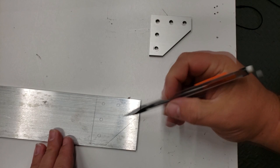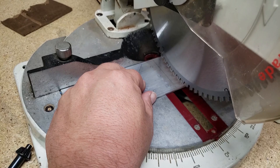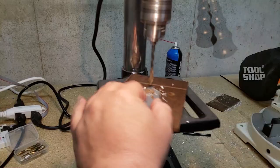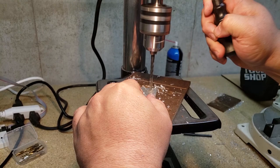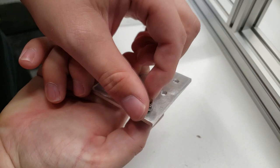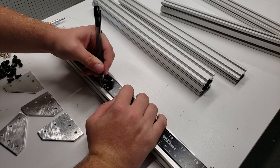Let's start our basic assembly. Our first step is to manufacture all of the plates we're going to need. I've included a link to my other video which covers this in detail. I made all of the plates for this printer build — you can purchase these on Amazon, though I did include a link. I can make almost all of these for about $6, and they run $14 for about four of them on Amazon. Once you have all your brackets made, use your 5-millimeter screws and T-nuts to get all of these plates set up to assemble the frame.